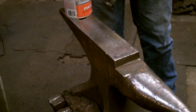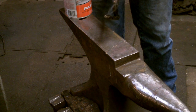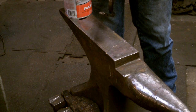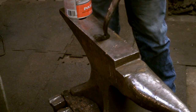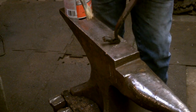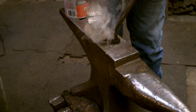Sometimes you have to let the piece cool a little bit so that the wax will build appropriately and not smoke off and burn off almost immediately. It's a very delicate balance because I'm searching for a high enough heat to burn the wax so it helps to darken, but not so hot that it evaporates the wax off. Make sure you get all the nooks and crannies.